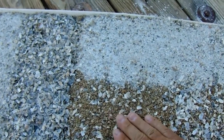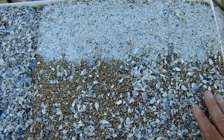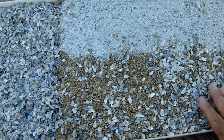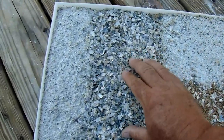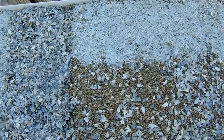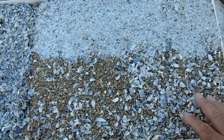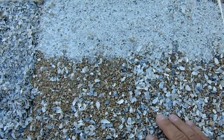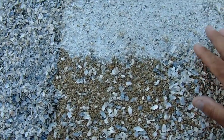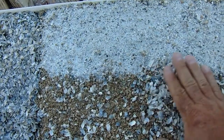You can pack this down with a lawn roller — it's going to be fairly hard and fairly fast. I've heard some people say the oyster shell surface plays a really slow ball. Well, the problem there is that you went from being an oyster shell blend to complete mixtures of just oyster shell and oyster shell flour. That's somewhat like running through dry beach sand — yeah, that's going to be pretty slow. The oyster shell is meant to accent and improve the mix and the spread, not to be the exclusive or primary component.